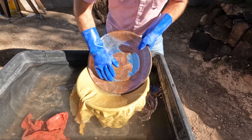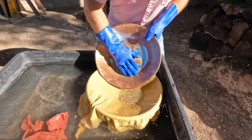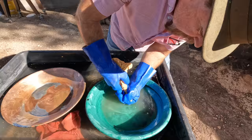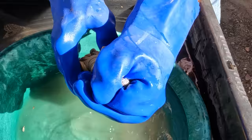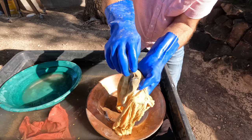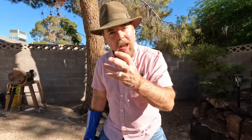If you don't want to put all that in a retort, you can run that through a chamois — it's so much easier, that way you don't have so much mercury to deal with. Just squeeze the mercury through the chamois — there's the mercury, all coming out — and keep squeezing it until it all comes out. That's our amalgam. I'm probably going to burn that and see what comes out. In the old days, they just scraped up the amalgam as it was, shoved it into a retort, burned it, collected the mercury back, and got their sponge gold. The downside is a lot of that mercury went over the shaker table and out into the tailings, and then down into the rivers, creeks, and streams. That's why you have so much mercury in waterways today — from all that runoff coming off the tailings.